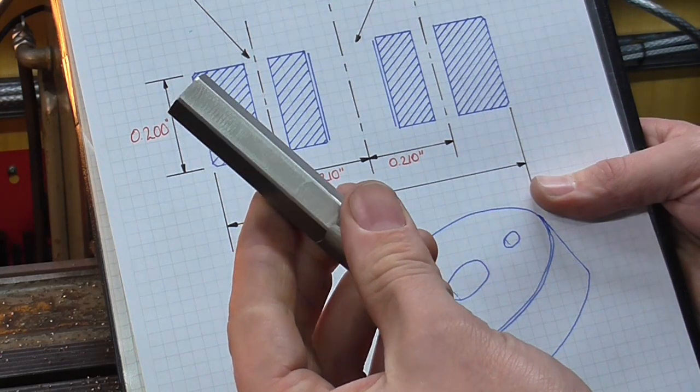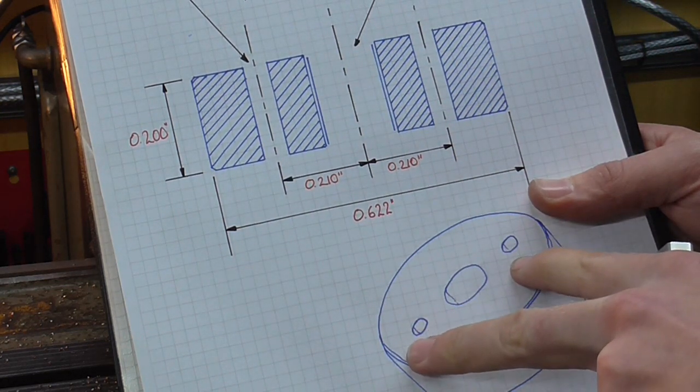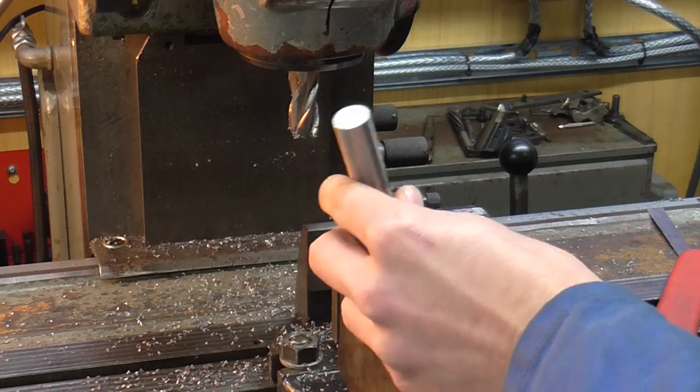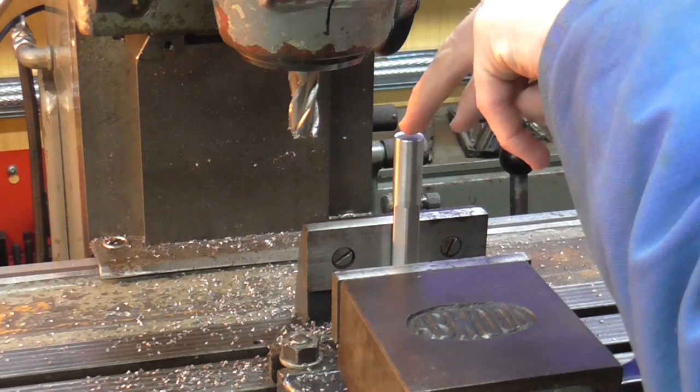The hexagon is sorted, but what about the disc nuts? The only other milling operation is to put two holes in for the pin spanner, and while I'm at the machine I'm going to do it now by reversing the component, holding it upwards, and putting the two holes in the top end.